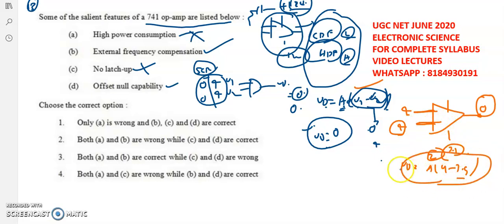Then automatically this operational amplifier will give a huge output voltage, right? So in order to avoid this case, how much drop is happening here? 0.1 volt of drop is happening. So what I'm doing is connecting a 0.1 volt voltage source here, and then we have to apply the voltage here. So now if I give 4 volts, then this 4 plus 0.1 becomes 4.1. This 4.1 goes to the second transistor BJT. Anyhow, it makes the 0.1 a voltage drop. So then the 4.1 becomes 4 volts. So now 4 and 4, now you will get the exact 0 voltage.